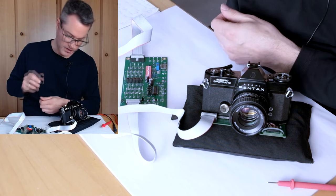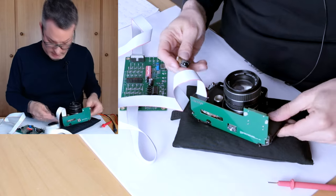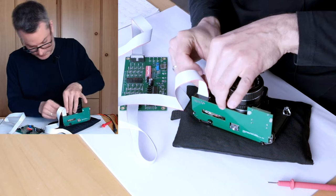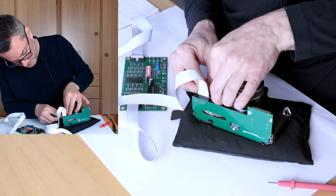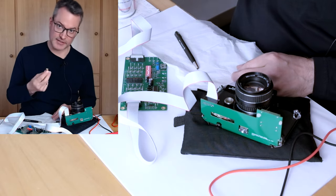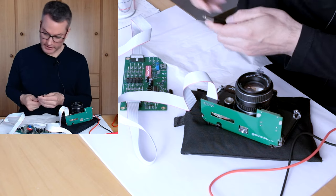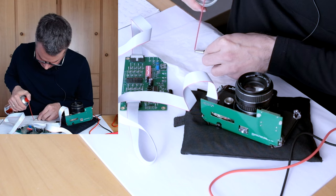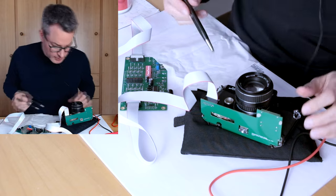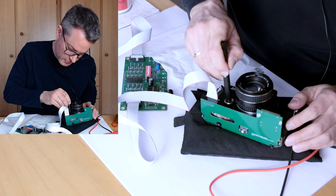In the battery compartment, the positive contact spring was deformed such that under some circumstances it was touching the chassis and effectively shorting the battery out. This took quite a toll on my nice silver battery, which was initially measuring at 6.3V and now is measuring under 6V. So we will be using the lithium battery until I get a new silver one. Let's put it in, positive inward, and close the battery compartment. It seems the battery is just not making reliable contact, so let's try using a fiber pen and some contact cleaner to clean up this contact spring.